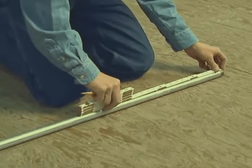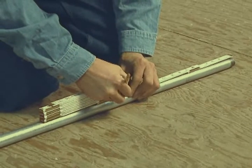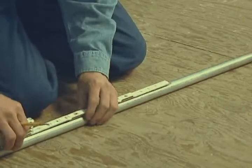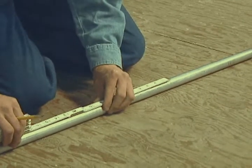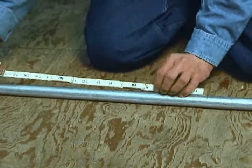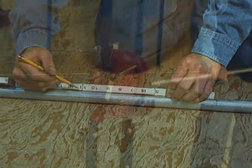The procedure to lay out and fabricate a four-bend saddle with the Mechanical Bender is as follows. Place the first pencil mark on the conduit for the first offset. Measure forward and place the pencil mark for the second offset. Place two more pencil marks outside the first two pencil marks for the end of the offsets.